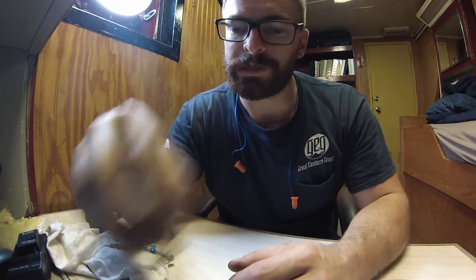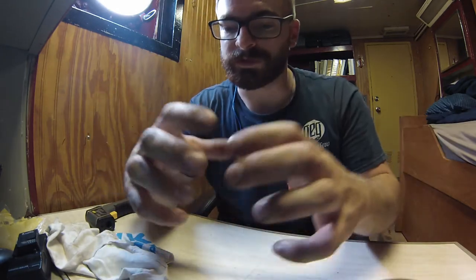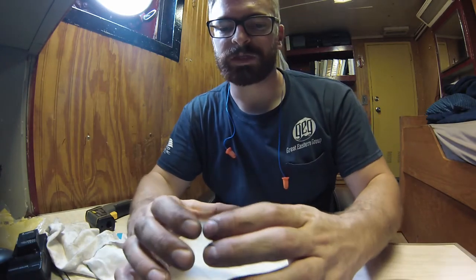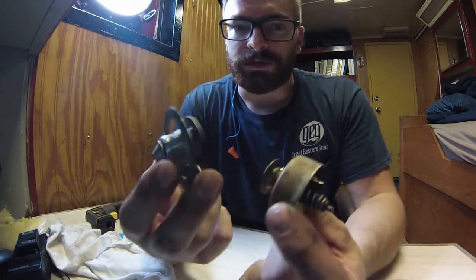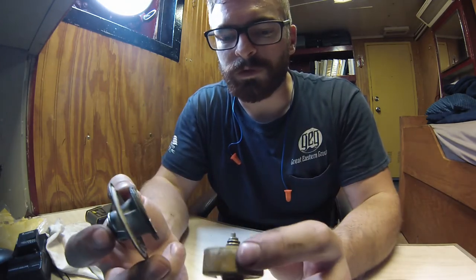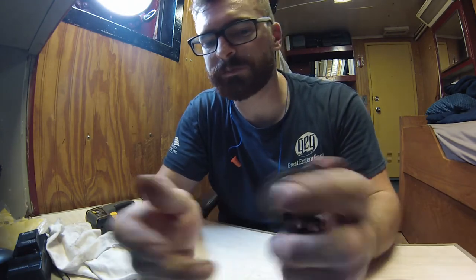They're super simple and they're in everything. Big engines have big ones — really big engines don't have really big ones, they just have lots of bigger ones. There are four of these things about the size of a soda can in the main engines, and then another two for the aftercooler, same size. This is a thermostat or a regulator depending on the manufacturer. They all do the same thing: they regulate the temperature.